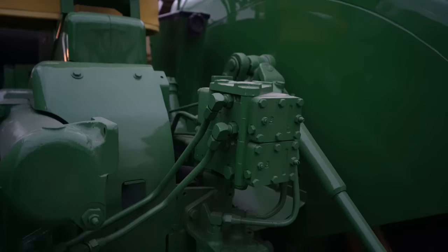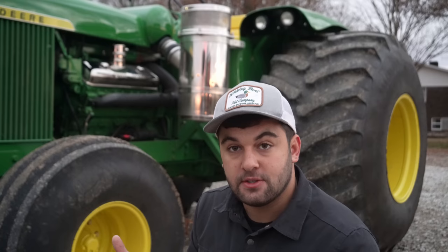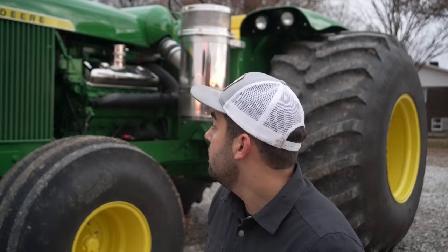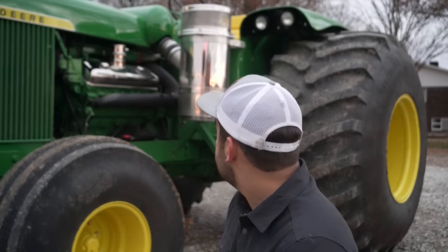Another thing that makes this tractor really cool is we changed all the hydraulics over to a console. All 5020s had their hydraulics up on the dash. The actual hydraulic remotes sat where they put the turbo, so of course they had to move them. We were lucky that they did all that before we got hold of it, which was way back when they were still using it. So they put all the remotes on the back of the tractor, and I took a console off of a 4620, put it up there, made all the linkages, and got all that to work. It's got two remotes and they both work in the console, and it's also got a three-point hitch with a quick attach on the back that also works in the console.